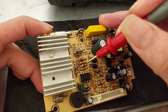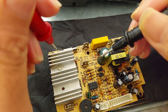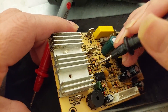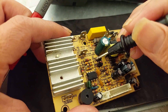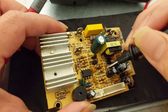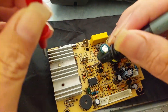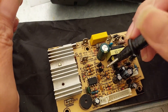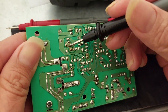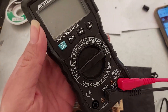With these color bands and capacitors — this cylinder tube is the capacitor. Usually I'm testing the resistor with one of the legs pulled up. As you can see, I already pulled up one of the legs, so make sure the reading will be accurate, because sometimes it will be arranged in series or parallel position. When you're testing on board like this, it will not be accurate because it's affected by other components. From the back you can see one of the legs is pulled up for testing.